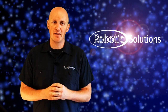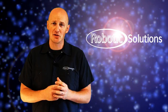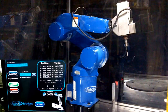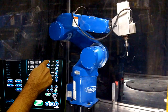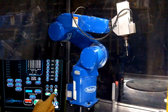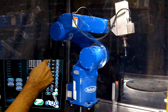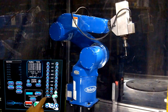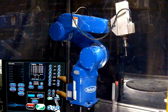In this next section, we're going to show you how to manually drive the robot if there's an instance where you need to reposition it. To start, bring up the advanced menu by selecting the Robotic Solutions logo. From there, push and hold the axis on the right that you would like to move in either positive or negative. You can select the Joint button to move the axis of the robot using the same buttons. When you have the XYZ button selected, it moves the spindle in the workspace left, right, up, or down with the same buttons.